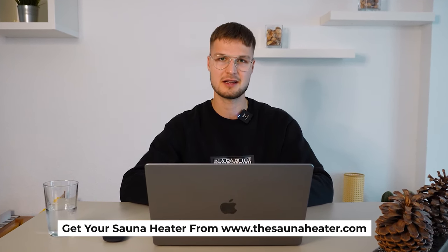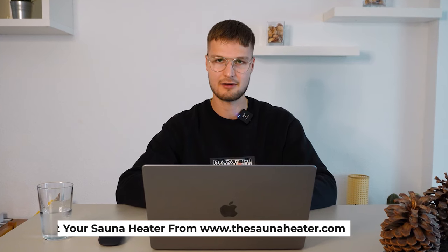So next, I want to talk about the factors for a good sauna experience when you have an electric sauna heater. All sauna heaters have similar heating capabilities, meaning that when your sauna heater is correctly sized, it can reach the maximum temperature that it is designed to go to. Most sauna heaters are limited to 195 Fahrenheit, and there are some exceptions that can reach 230 Fahrenheit, but there is always a limit. That's the maximum temperature your sauna heater can reach, and the heat will be the same regardless of the heater itself. And proper ventilation in your sauna is crucial.